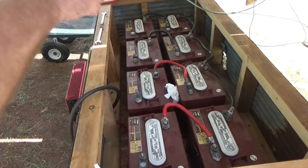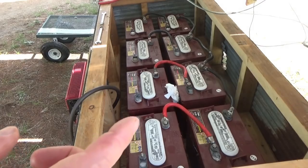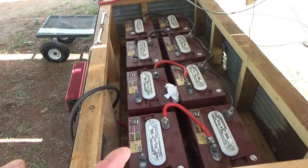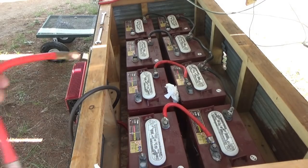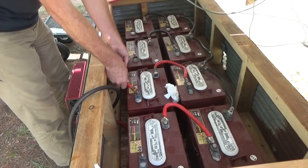I did not put a nut on the outer two wires because I still have to connect the solar panels in and the power going out. Now I'm going to hook up the positive wires between all the batteries, plus to plus to plus to the other way across.